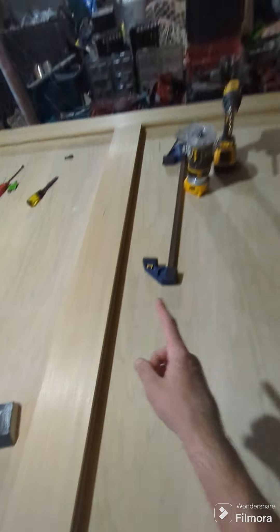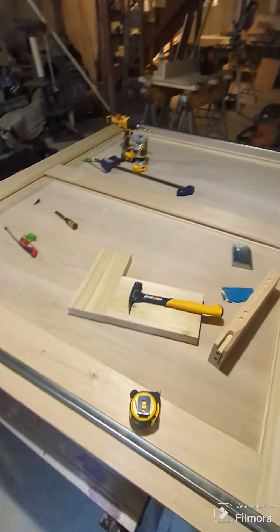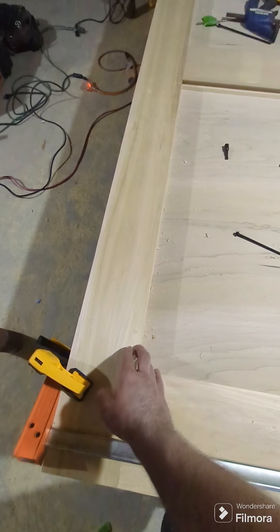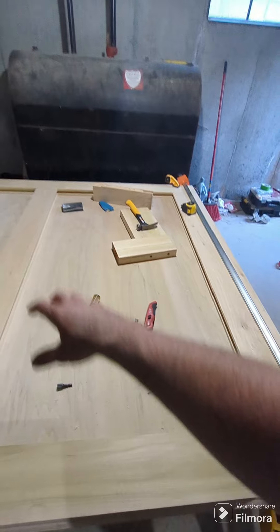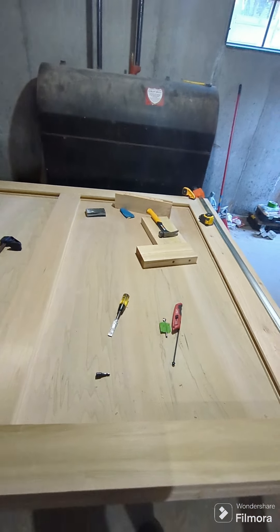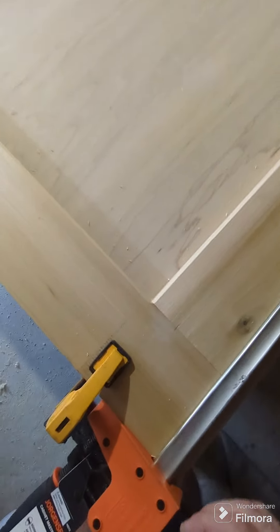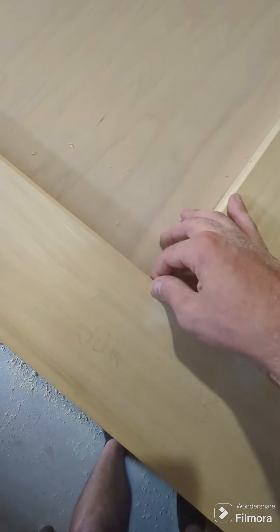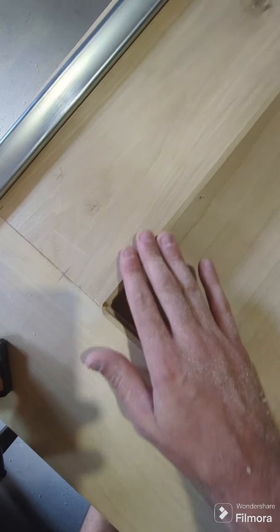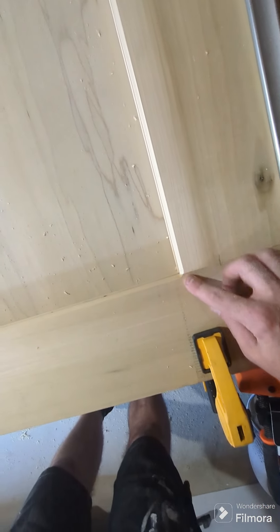This is where it's at so far — some super tight, nice flush joints. We have a three quarter by three quarter dado all the way around; it's just dry fit right now. It won't fit out the bulkhead but that's all right. I'm pretty happy. We chamfered all the way around and rounded over the outsides. I'm going to do an MDF panel with v-grooves cut every six inches on both sides to give this thing a real look. I kind of like the little curve transition.